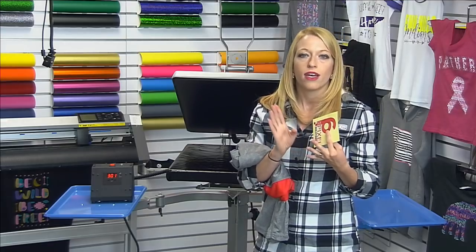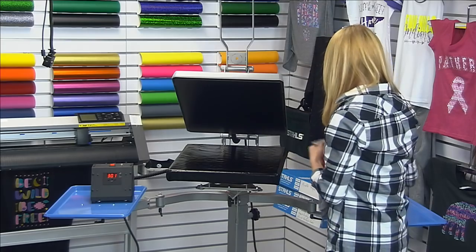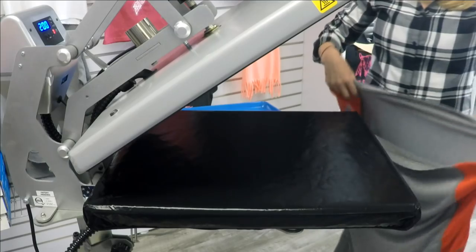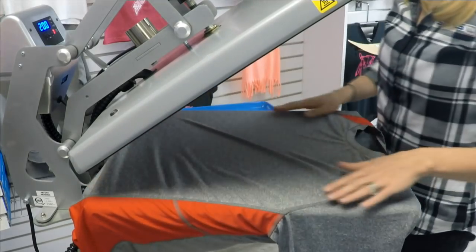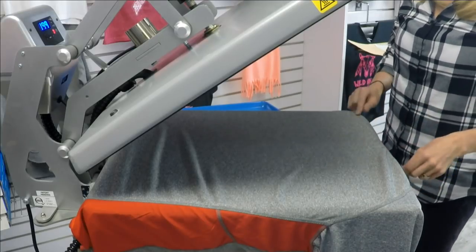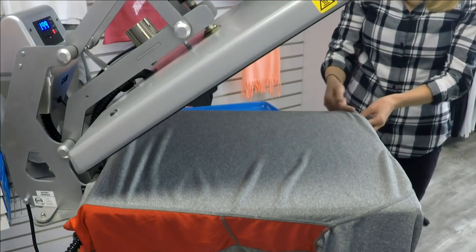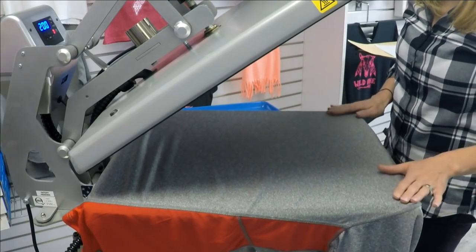One of the great things about the heat transfers from Stahls is that we have a low temperature adhesive option for pretty much any logo type. This would be Super Tech Foil Tech — anything in the Tech line: Super Tech Opaque, Super Tech Sublist Stop, Foil Tech — they all apply at a lower temperature. I'm going to thread this shirt on again, separating the layers so the heat from the bottom doesn't have to work too hard to reach the adhesive. It's really important with performance wear in general to get seams and collars off the platen, because too much pressure in those areas can gloss up the fabric.